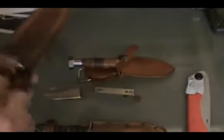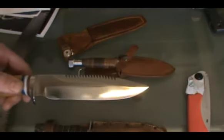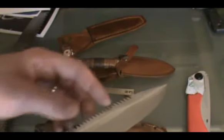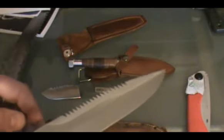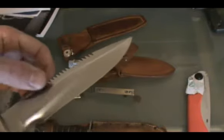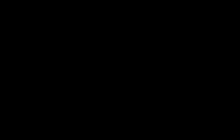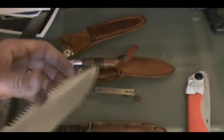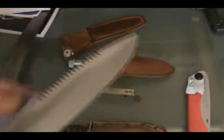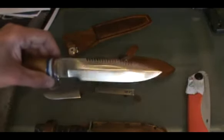This is a standard Randall 18 blade — actually an 18 or a 15 saw teeth. You can see here, same thing: just a basic cut, sort of triangle-shaped teeth. The difference is Randall has put a top grind on these knives, which makes the saw teeth thinner. You can see how much finer they are. From what I understand, the purpose of this is just to grab the aluminum or plexiglass and to tear it — not necessarily to cut or saw through. These are some of the worst there are for wood, and I'll show you why.